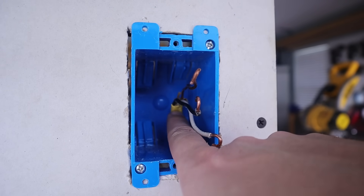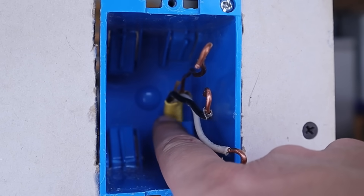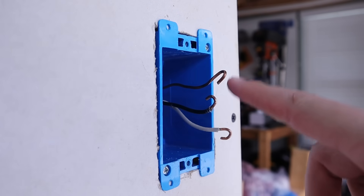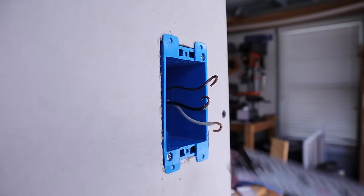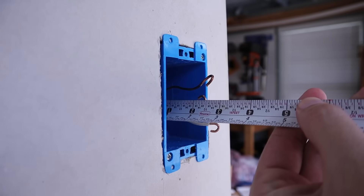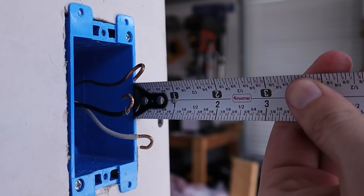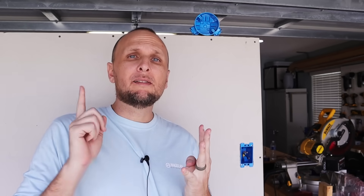What that's saying is: from the yellow sheathing at the back of the box — that's where the measurement starts — you need at least six inches measured from where the wiring exits that sheathing out the front of the box. Additionally, the wiring needs to extend at least three inches past the edge of the box. Currently, we have approximately two and a half to three inches from the sheathing, and only about three quarters of an inch extending past the box. I'll show you a few fixes that are quick, easy, less expensive, and still code compliant.